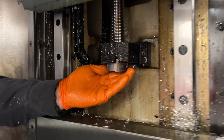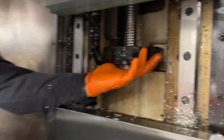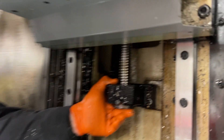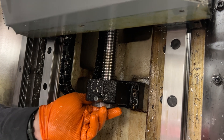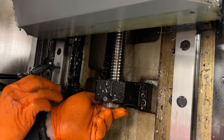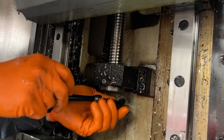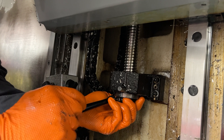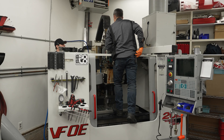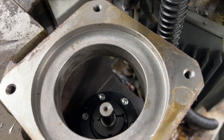This tool is to lock this thing in place so I can break the top. So you notice as he's jacking, the ball screw is spinning. So I got a little tool so I can lock it in place, and then I'll use the mag base to kind of hold it from moving while I go up top and crack it loose. Once I got it loose, I'll tighten the jam nut so I can loosen up the bottom one.